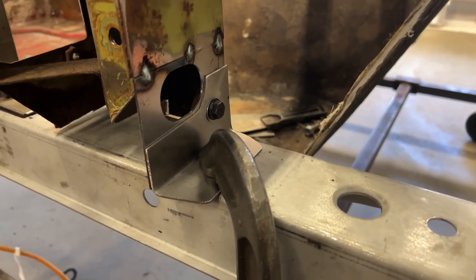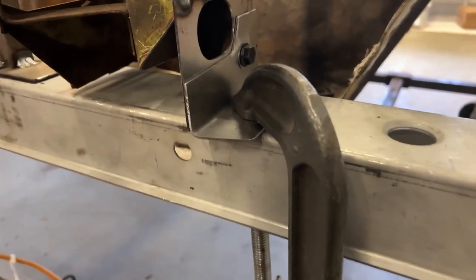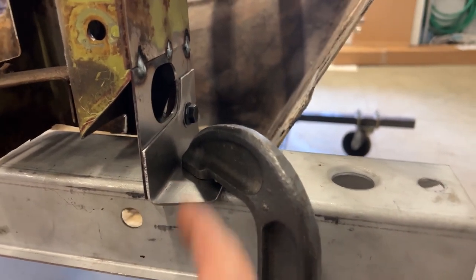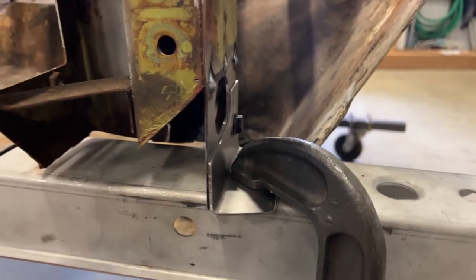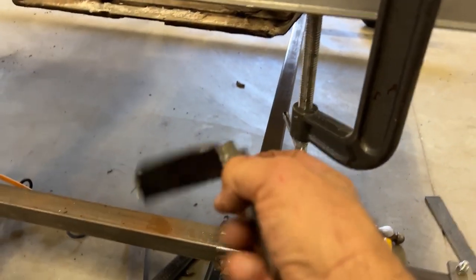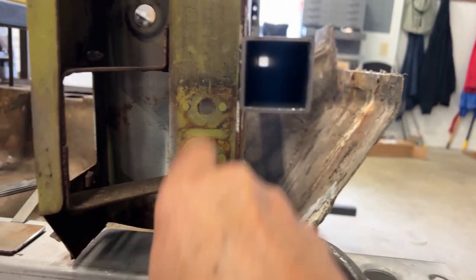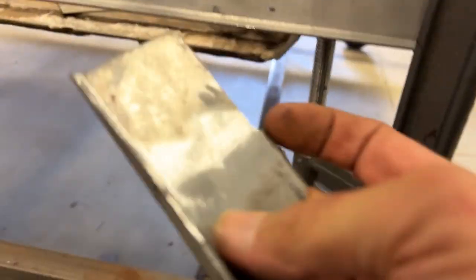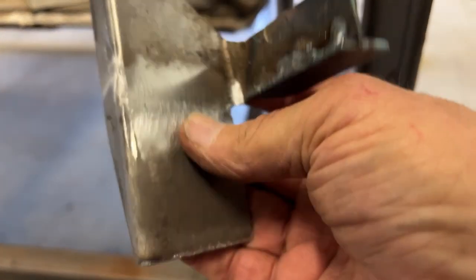As I said before, I fabricated the front part of the hinge pillar and the bracket here that will be spot welded to the hinge pillar piece and the rocker. And then I constructed this piece. Of course, this particular part of the hinge pillar is a lot heavier duty gauge. So, you know, heavier gauge. I actually formed this out of three pieces to simplify everything.